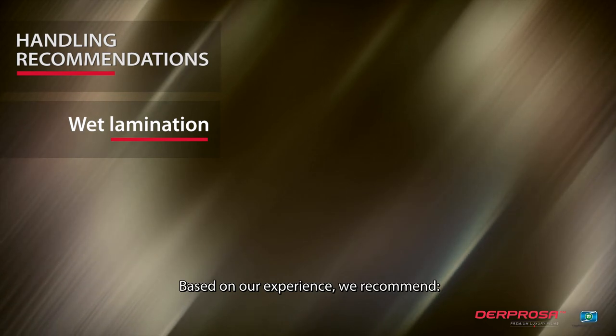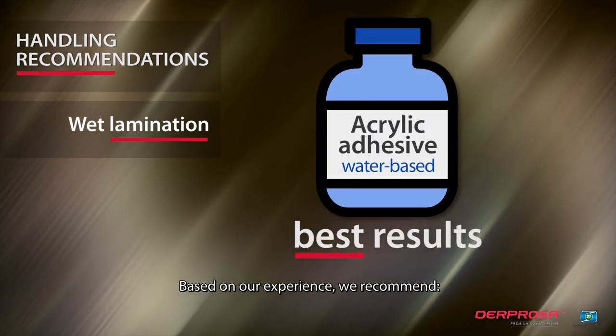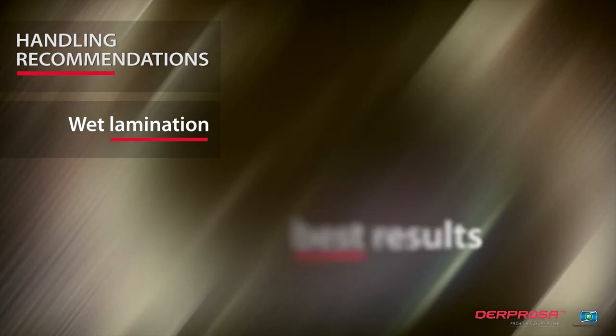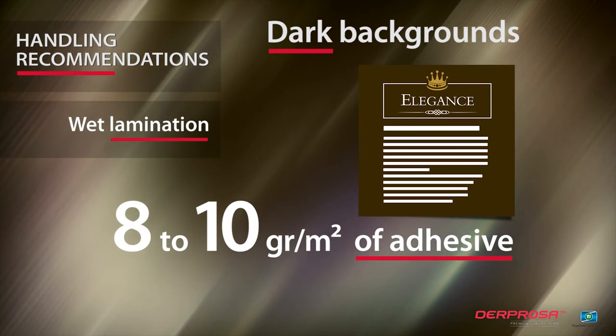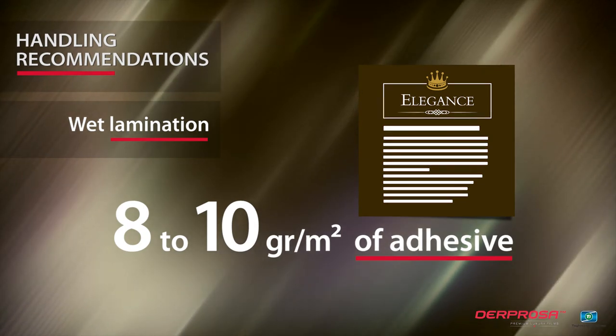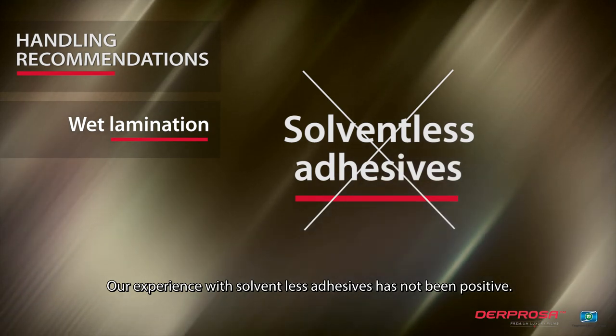Based on our experience, we recommend the use of water-based acrylic adhesives for best results. On dark backgrounds, we suggest using 8 to 10 grams per square meter of adhesive. Our experience with solventless adhesives has not been positive.